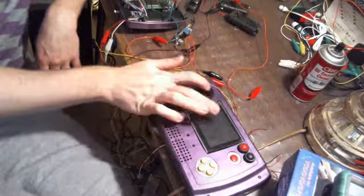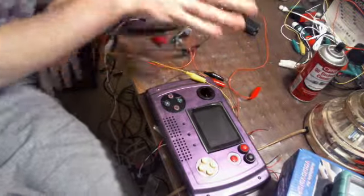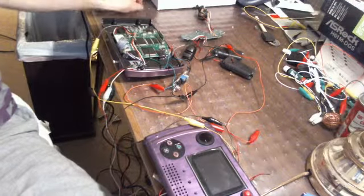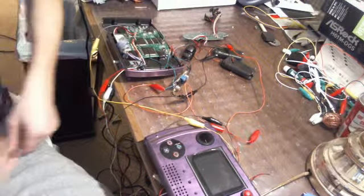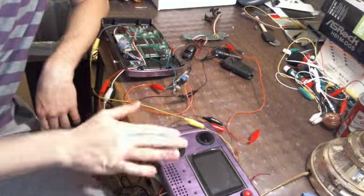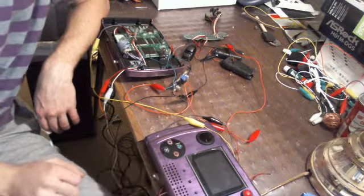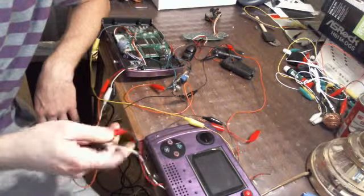The analog is next to be installed with the buttons and stuff, but I got everything kind of... it's kind of a mess right now. As you guys can tell it's kind of a messy area — most of the stuff I pushed out of the way. But the controller is right here, it's all hooked up, all soldered to the actual motherboard itself. The only thing not soldered right now is the D pad, the C pad, A and B, and the start button. Oh yeah, and the speakers themselves aren't soldered yet — I got them hooked up to the wire here with these little alligator clips.